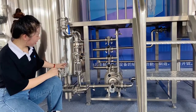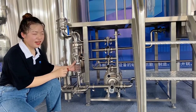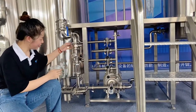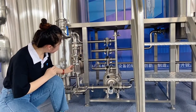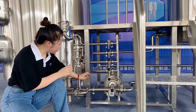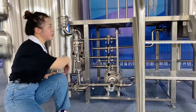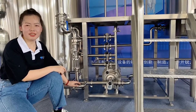Next to the whirlpool tank it is fitted with a side glass, so you can observe the color and clarity of the wort. Next to this vessel is our wort pump — this is a powerful pump that transfers wort from this tank to another tank. Our pump is rated at 0.75 kW.